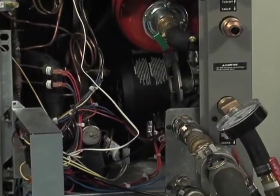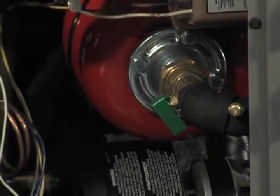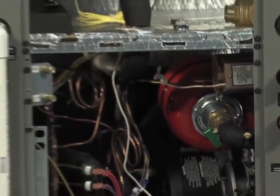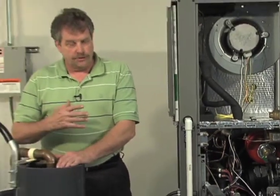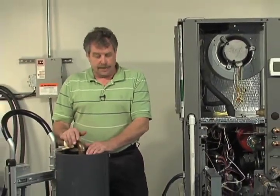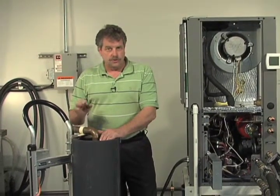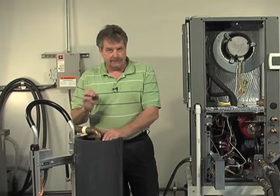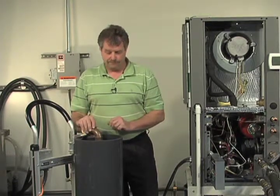We'll want to let that circulate for a little while. All right, we've performed several deadheadings. We're confident we've got all the air removed. Again, this will be that point in time. If you're introducing antifreeze, you rotate those flushing valves inside the machine and introduce your antifreeze. And always, if you're adding antifreeze, you do the antifreeze level check. Make sure you have the concentration and freeze protection level that you need.